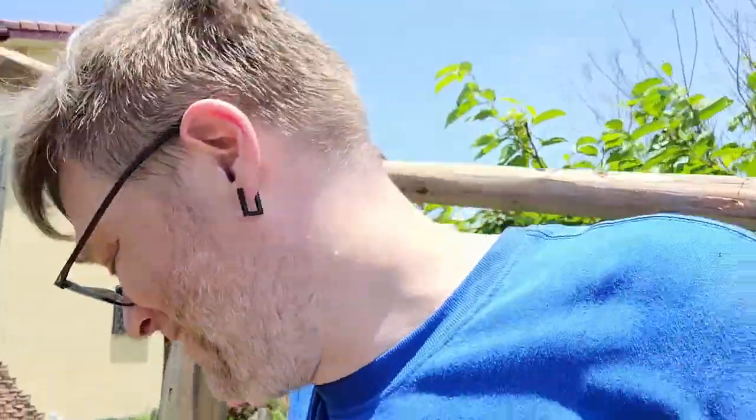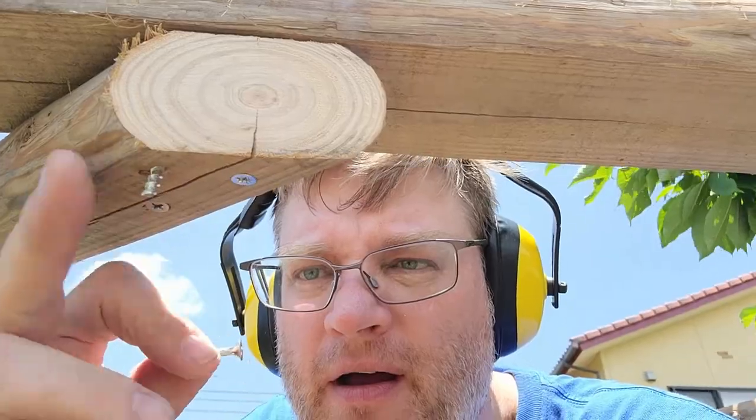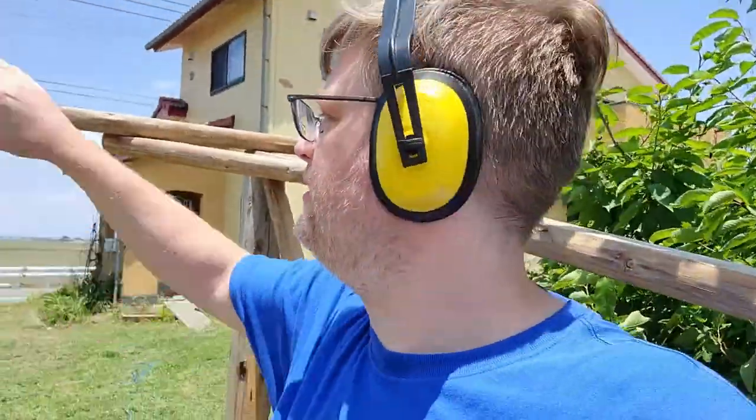That should help some torsional strength. Quick recount, I think I have just enough. Yay. Okay, I got these 4 done. Got one screw right here, snap off. Probably just hammer that in down flat, and already it's a lot more torsionally sturdy. And I just snapped my last 2 millimeter drill bit. I could try without pilot holes, but I might split the wood.